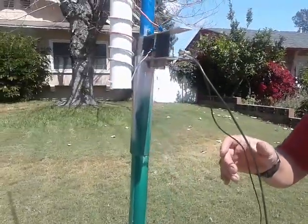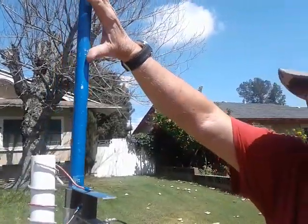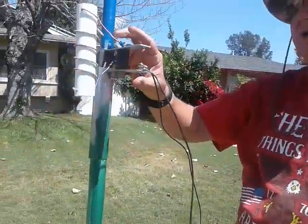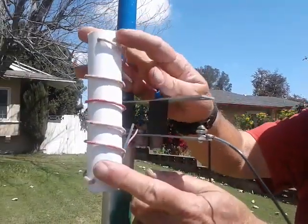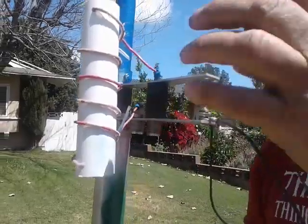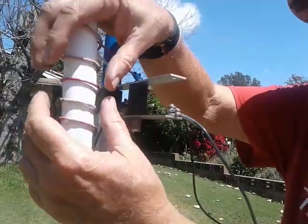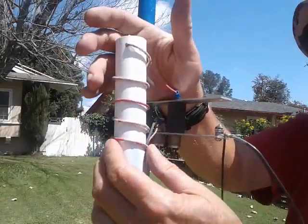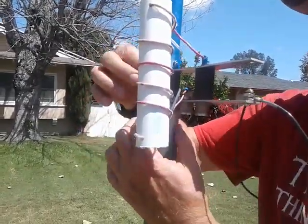What we have here is 135 inches, which means it's a 5/8 wave on 6 meters. Then we have a counterpoise that's also 135 inches. We come to the center and these things have to be 5/8 over 5/8, which means there's a quarter wavelength we have to hide electrically. Generally speaking, that's about 50 inches and it should be wide-spaced. Otherwise, if you put these coils next to each other, there'll be so much capacitance it'll start resonating and the phase won't be right at all. So you want to wide-space it — it's going to be between 30 and 50 inches of wire depending on the amount of capacitance created by these connections right here.